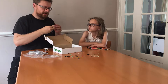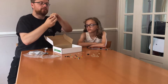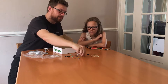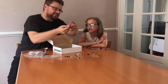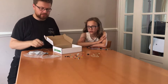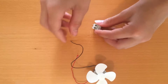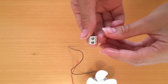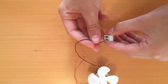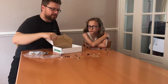This one has two screws in the top and two electronic wire legs out of the bottom. Most components will push directly into the board because the legs are stiff — they're not floppy wires. But the motor has very floppy wires and trying to push those into the holes would be difficult. So what you can do is unscrew the screws a little bit, put the wire ends through the little holes, and then tighten them back. It's a way of mounting other things that don't have stiff wires.